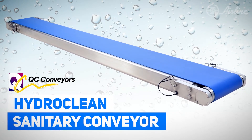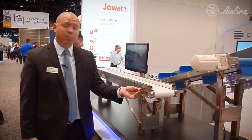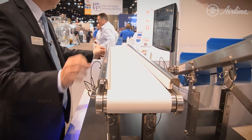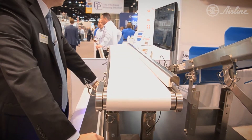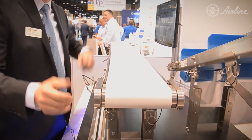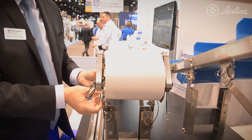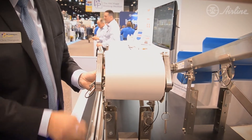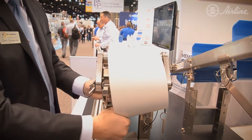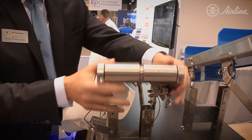It's built on a stainless steel frame that can be completely disassembled without tools. Everything is handled with pull pins that are along the length of the conveyor that let you completely disassemble it without a single tool. You can remove the sides and guides. You can flip up the tail to relieve tension on the belt. There are pins on the side that you can pull to detach it from the stands, and that gives you a path to remove the belt from the conveyor completely without tools.